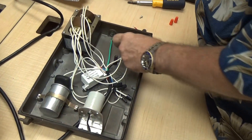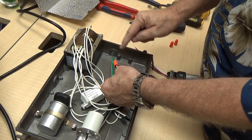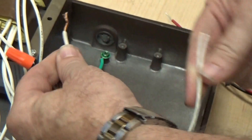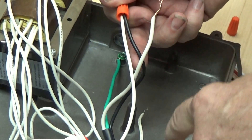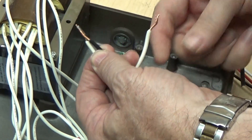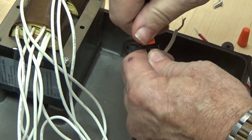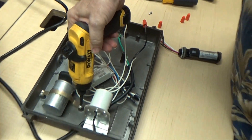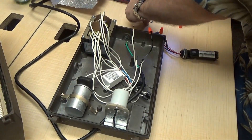If you have a voltmeter, check between the ground wire and inside here to make sure there's no power on. Once you confirm there's no power, start with the neutral — disconnect that. Then disconnect the black wire coming from the power; sometimes it comes from the back, sometimes from the side. This is typically the hot wire, so when you disconnect it, pull the wire nut off, hold that to the side, and put the wire nut back on. Start disassembling all the parts and save all the screws — you're going to need them.